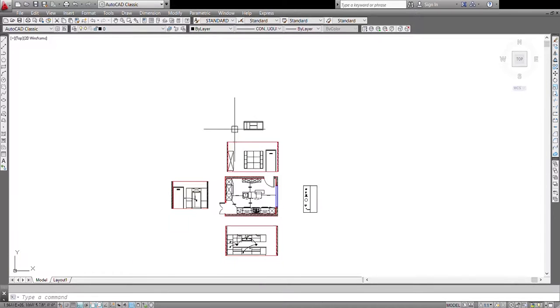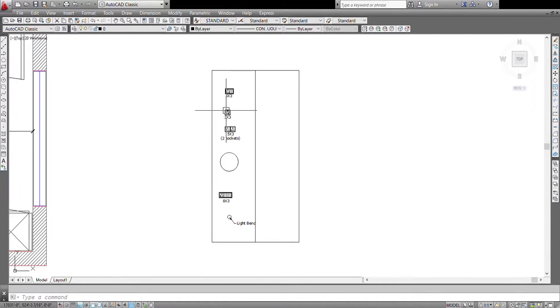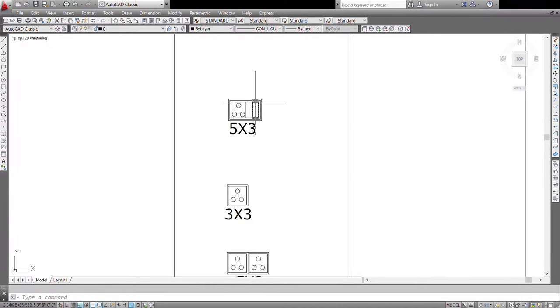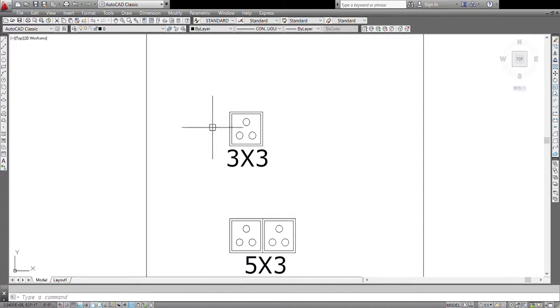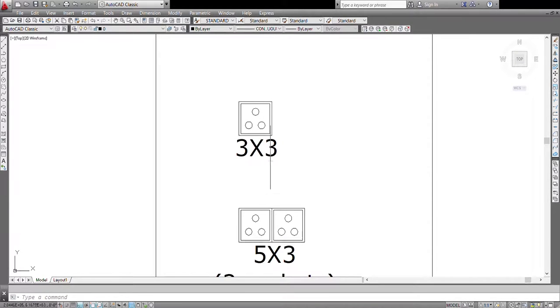Before doing that I will show you the modules I have created. We'll start with the 5 by 3 module. Basically this 5 by 3 is the size of the board — 5 inches by 3 inches — and in a 5 by 3 board you can get one socket and two switches, so it can be used for the fridge and lights. This is a 3 by 3 — only socket — this is used when you have to provide a direct supply of electricity. You can use it behind the fridge since the fridge is not turned off regularly, and also under the sink section for the RO.